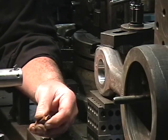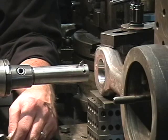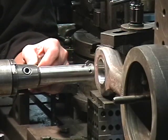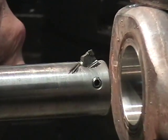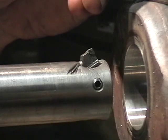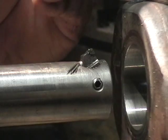My homemade tooling is hard tooling. They have a completely different tool geometry. I'll bring this out and zoom in so we can get a bit of a look at the tools I use in these boring bars. This is a TSC tool, or what's left of it. The carbide on it used to be the same as the one I've got on top of it — I pretty much get all the squeal out of the pig. I grind it myself.